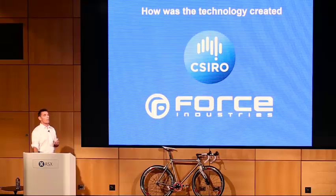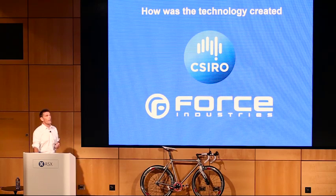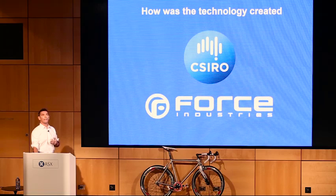What we came up with: we found another process invented by the Russians back in the 1980s for doing thin coatings of metals onto other metals. We looked at this process and thought — it's not a melting point process, there's no oxidation. Why hasn't anyone looked at this more deeply? We did a lot of research and found no one had done anything. So we decided to take this 3D coating system and turn it into a 3D printing process — mounting the spray gun onto a robot and creating robot pathways to spray any shape we want and build up near net shapes.